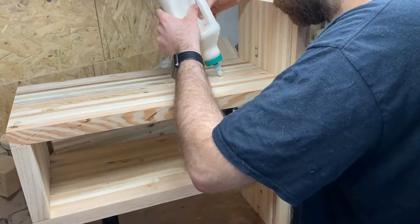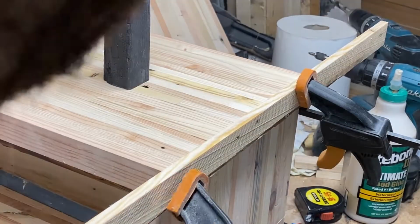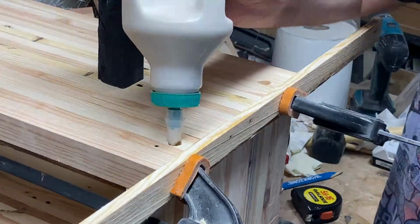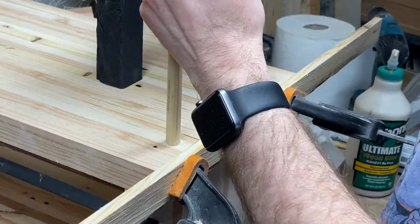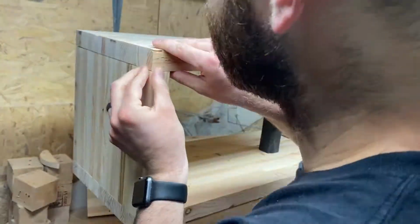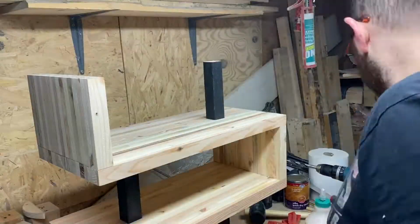So as you can see, that's now got the full part of the shoe rack done. Now I'll be adding the base and then the top. I've added this extra piece here because I had a blowout in the last one I did. It should stop anything from blowing out because there's a support there now. So again, just adding screw and dowel. Now adding the base. Clamp that down, and then I would move on to do the top as well now.